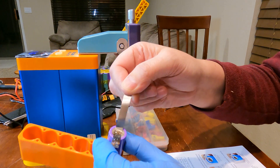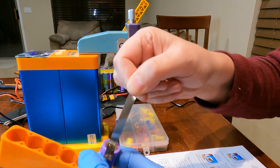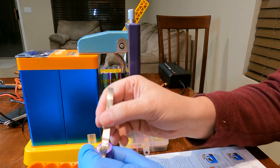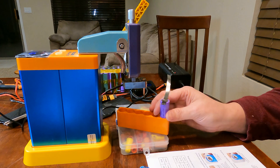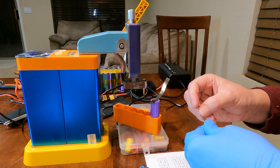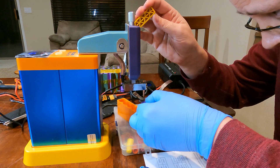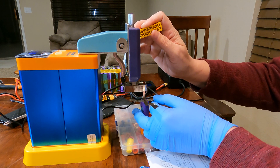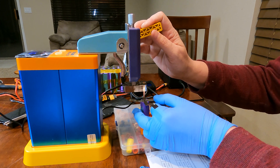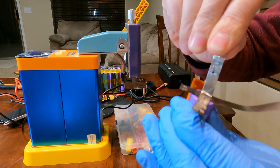Seems to be on setting 30T. Per each spot weld I'm doing two shots of it — I wait about a second or two in between each shot. And that seems to be my best bet with these particular strips. Now that I know my setting, I'm going to see how hard it is to attach a piece of strip over a piece of strip, because I'm going to have to do some overlaying to get the proper amps out of it. Easy peasy. Same technique — two bangs at 30T, three sets of them. Yeah, that seems to be a good technique to attaching the strip on top of the strip.